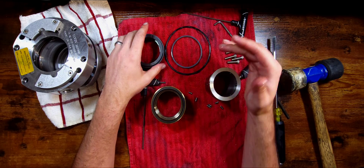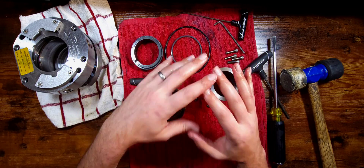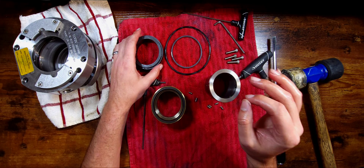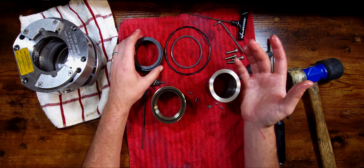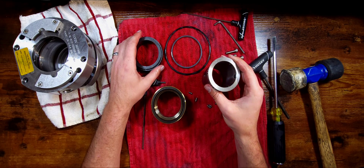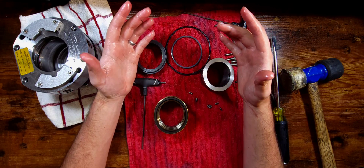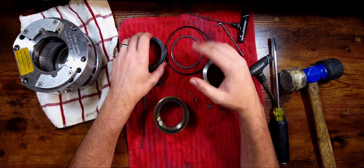That's why I highly suggest going ahead and preemptively doing this — because if it's functioning properly and the alignment on the motor and all that's good anyway, you'll be able to get very extended lengths of time between having to do them. I've got machines go 10 years and never need a shaft seal. It's all about how well you take care of the machine and how good your motor alignment is. It's a heart-sink moment when you open up the D-housing on the compressor and what's inside waiting for you is literally a little bit of standing oil inside of there because that bottle had filled up to the point where it couldn't hold anymore.